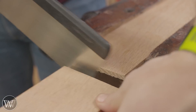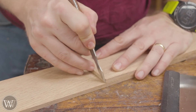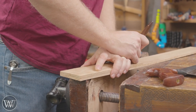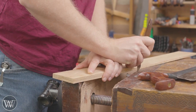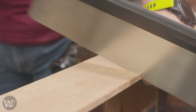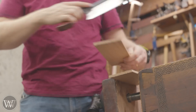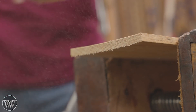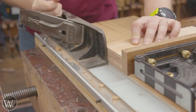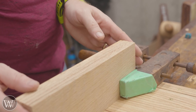I need to cut five of these so they can be spacers in between all six of the different slots. I'll mark across and then cut it. I could do this in the bench hook but I find it's just easier to do it freehand. Once I have one of them cut I'm going to use that as the pattern and mark all the rest to that. That way if there's any variance in the first one it really doesn't matter. Once we get all of these cut I'm going to stack them all up and shoot them so they are all flush, clean, and exactly where I want.